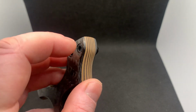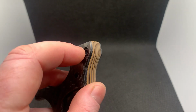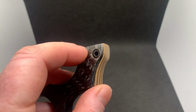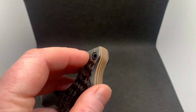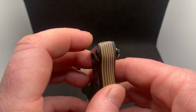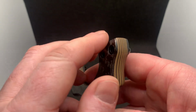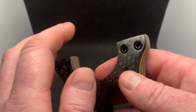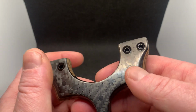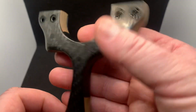So I countersink these right in deep into the carbon, so they come out into the clip. But then they're a little bit too far in, and it's harder to put your thumb on them to tighten them up because they're in too deep. So in sanding the faces down, we kind of keep them close to the top. It's something I do now. There's been a couple of builds in the past that haven't done that. Regret doing it. No one's ever messaged me back with a complaint. If they did, I would happily work on their frame and sand the face down for them. There'd be a small charge, I suppose, because it's going to take me an hour to do, but I would do it. We're nice and level here. We're looking good.